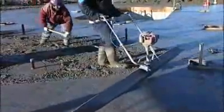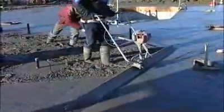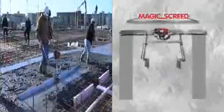The Magic Screed does not need any kind of support — it rides on wet concrete. It requires the same conventional methods as screeding by hand: pour the concrete, prepare four leveling points at a distance that depends on the size of the blade used, then screed a path about 12 to 16 inches wide on both sides following the leveling points, creating an unscreeded surface in between the wet pads.